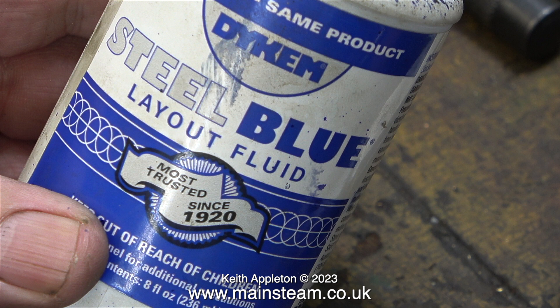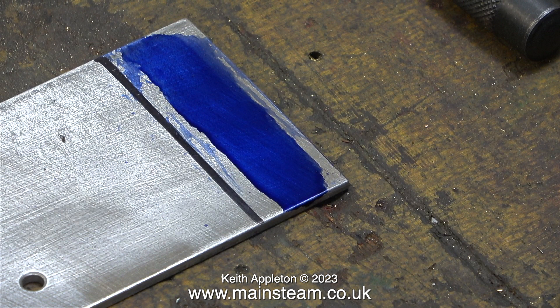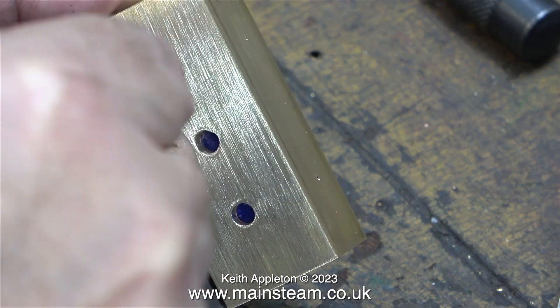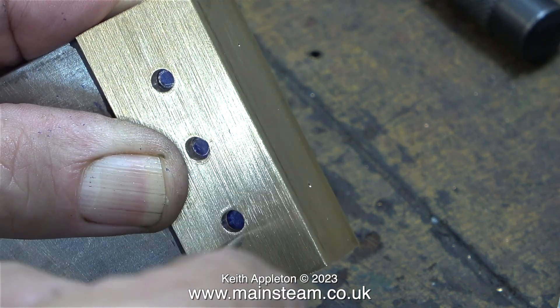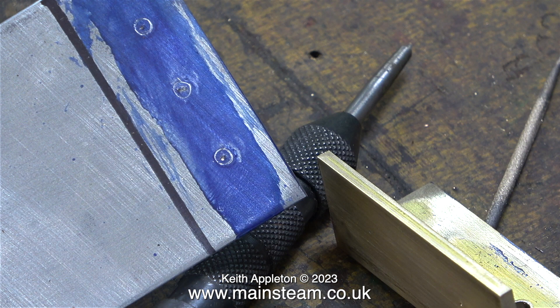With the first three mounting holes drilled in the piece of brass angle, it's time to transfer these holes to the steel upright. For this job I'm using some steel blue layout fluid — here it is painted on the steel. All I have to do now is hold the piece of brass angle onto the steel plate and use a scriber through the holes to scratch the marking-out fluid. I end up with a nice neat ring, and here I'm showing what not to do — using my spring centre punch I've purposely put the centre pop marks in the wrong place, inside the small rings you can see on the steel.